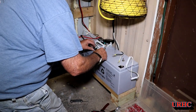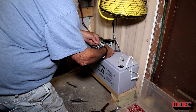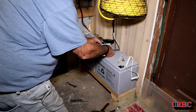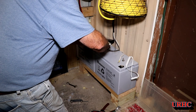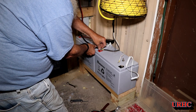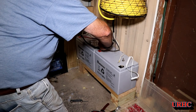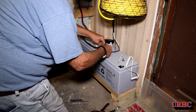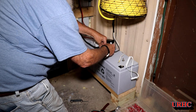I'm just working on connecting these batteries together. You can see my old cables were just barely long enough — these are a little bit longer battery. I'm going to connect everything on the hot side first, and then go back and connect the ground side. They give you real nice threaded hardware that comes with the batteries. You do want to make sure you're careful and have your polarities right at this point, because you actually can do a lot of damage if you don't, and you can actually get hurt with this kind of energy potential in these batteries.